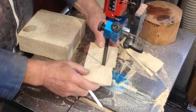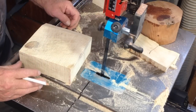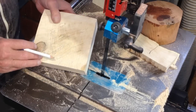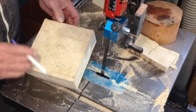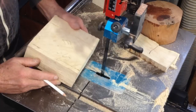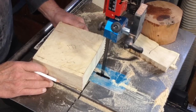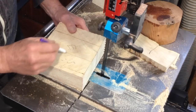This saw does not have a foot brake so I'll jam it to a halt. Now what this has shown is it's actually come up with a bit of figure — it might be quite difficult to see. So that'll look quite nice in the bottom of a bowl. And there's a figure coming across there too. But that says it's end grain, so the grain's all over the place in this. I won't really know what's going to be happening until I get into it. Anyway, that stays as is — and again if it splits up I've still got the option of cutting it into squares.